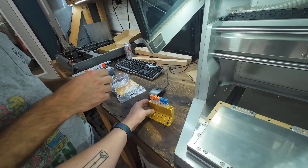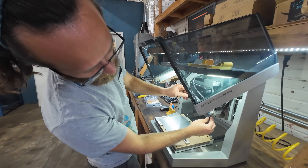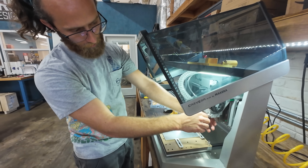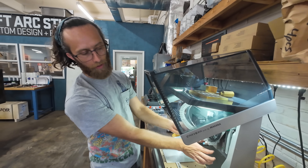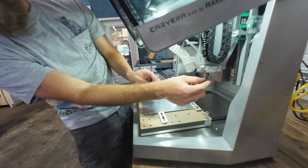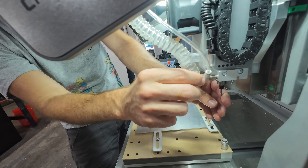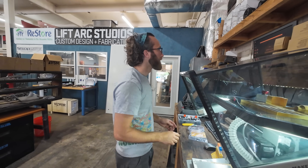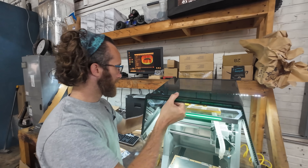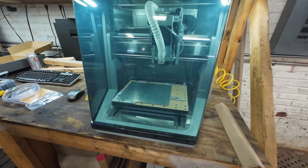The tool holder is actually meant to be magnet-mounted so it pulls over to the tool changer side — I just don't have the magnets in yet. We have the air compressor hooked up; you can't run the vacuum and air compressor at the same time because the shoe would get in the way. Look at this neat little nozzle — you can turn it and use this lock washer to adjust pressure up or down. I'm going to close it for this cut because it's going to be blowing chips everywhere with all this very fine detail.